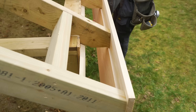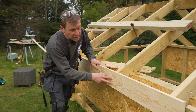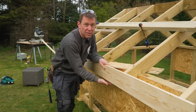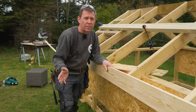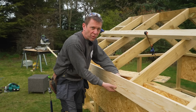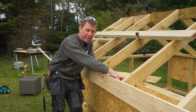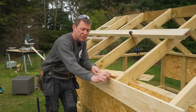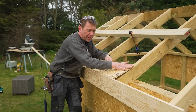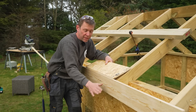Now we can get the soffit into the groove. Here we have our fascia and soffit — normally I put two fixings in these but it is only a model. There are different ways of doing fascia and soffit: some people prefer to nail the soffit in place and then put the fascia on. If I'm doing plastic, sometimes we've got a lintel so you can get the plastic between the brickwork, blockwork, and the lintel, which really holds the soffit nicely and then you can just hook the fascia on. Sometimes these get vents in the soffit, or over-fascia vents. Other times we put some boards here so that when the tile battens come down it brings a kick and stops puddling, letting water come straight down into the gutter.